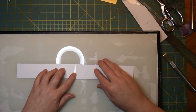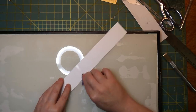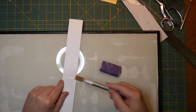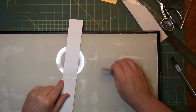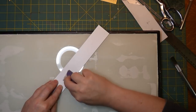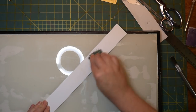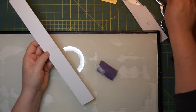I can feel just a little bit of unevenness so I'm just gonna take the sandpaper. I can see this piece is a little bit higher than this side — there's a slight gloss shine on one side of the line and no shine on the other side. I want to sand this until that shine is gone. Then we'll take the green pad again and smooth that down to get rid of the heavy sand marks. When this gets painted that seam will be totally invisible.